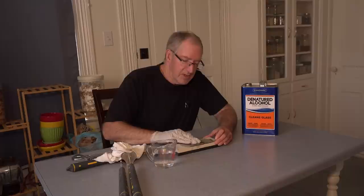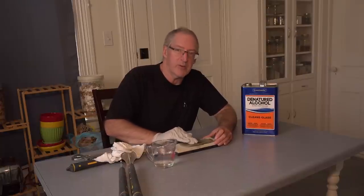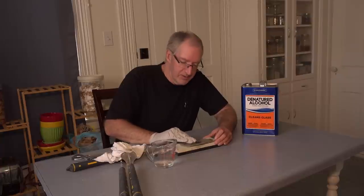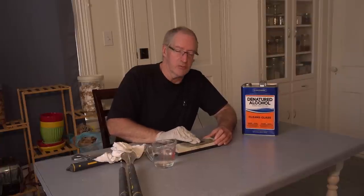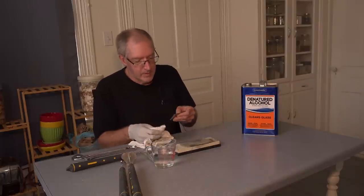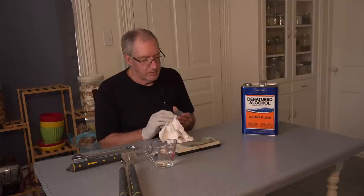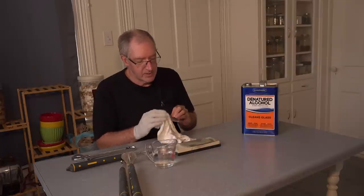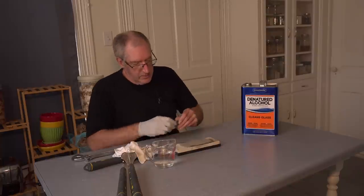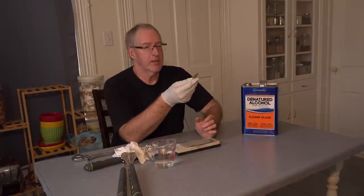The main thing is you really don't want your stone to be dry - you want it to be wet. These stones have an amazing property where they can soak up an awful lot of water. When you store them, store them somewhere they can dry out - somewhere the humidity won't hurt anything. Don't stick it in your toolbox. Every once in a while I'll stop, dry it off, wipe off any residue, and take a look to see how we're doing.